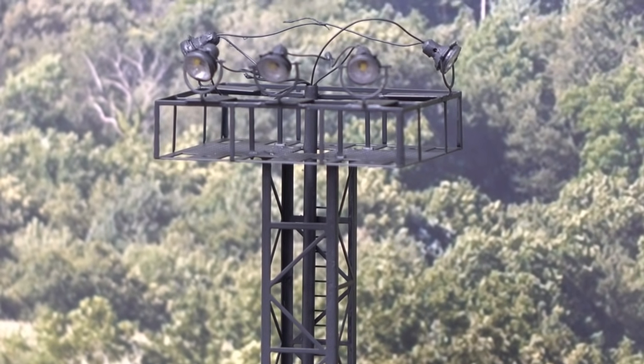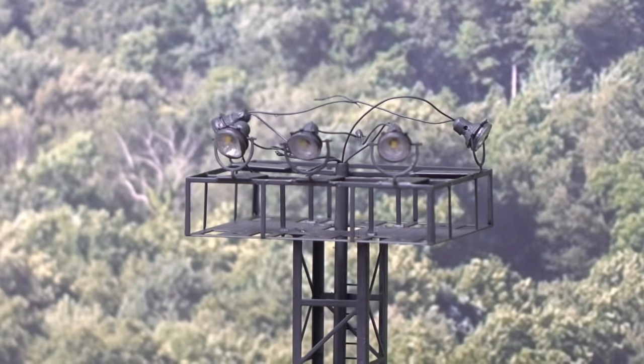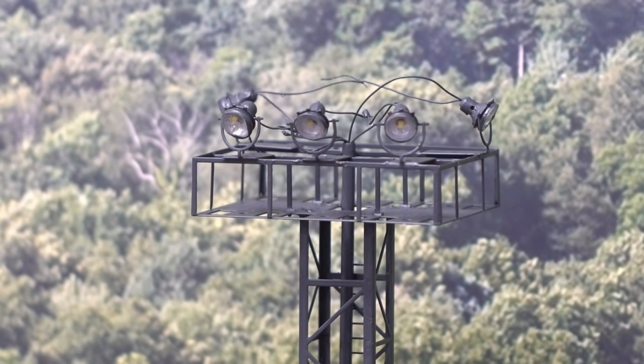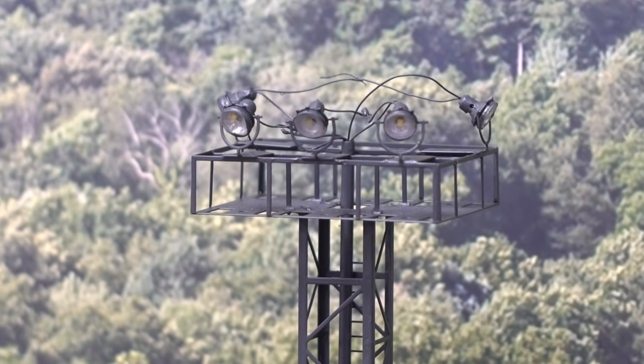And what I decided to do was run, there are 3 lights in the front, they're on 1 current limiter. The 2 lights to the sides are on another current limiter. So I brought all the cathodes together and brought them down with one 30 gauge wire. And then 2 30 gauge wires I brought up from the current limiters, which are down below the layout. So there are 2 independent circuits: 1 circuit with 3 in the front, and 1 with 2 on the side. And then the wiring's a mess, but it is what it is.